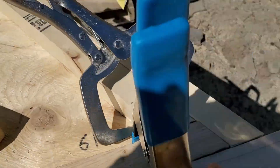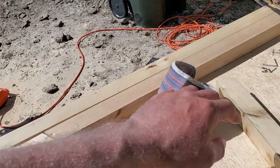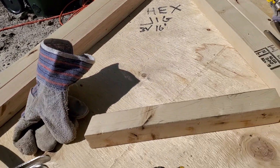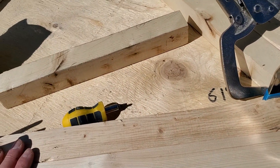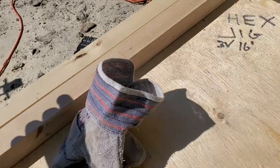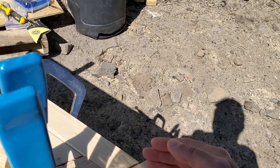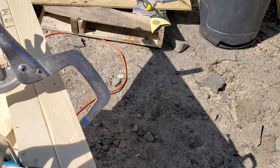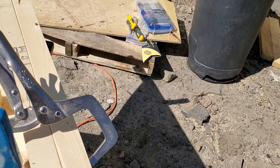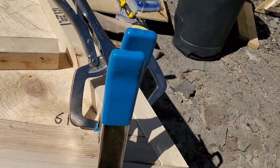I take my pencil and draw that line, same thing on the other ends, then go to the table saw and cut them to the length I need. They'll end up looking like that. Then I clamp them nice and snug on the jig, drill into each end — one down here and one through here. Then I take the handsaw and cut off the excess. I find it's handy to make a nice light line about a millimeter or two deep first. As I'm cutting — there's a slight beveled angle — that line is my guide so I get a nice straight cut.